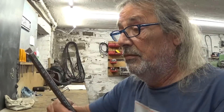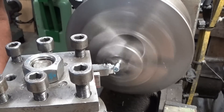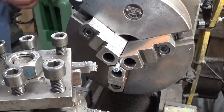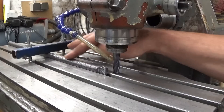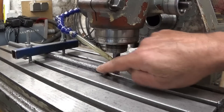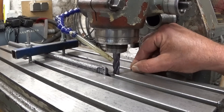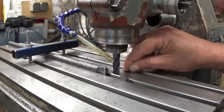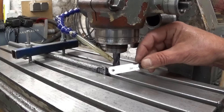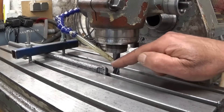Last thing to do is make a little bolt to hold the insert in place. And of course also make two flats to prevent the thing from rolling. I installed my future tool directly on the table so I'm sure it is aligned. I squared it up with the brand new surface I created. My cutter is really close to the table — this is a 0.5mm thickness and it barely fits. It's a little bit stressful, but let's create a flat.